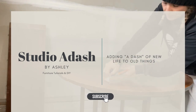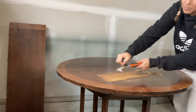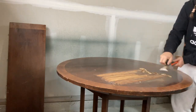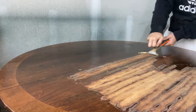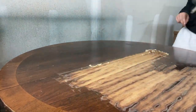If you've been watching any of my previous videos, you know that I start almost every project by grabbing my carbide scraper. It helps remove the old finish so much faster and less messy, in my opinion, than a chemical stripper does. I also like to start with it because it actually saves a lot of money on having to use so many sanding pads. This just speeds up the process and saves me money.